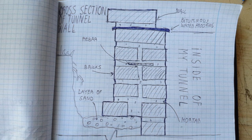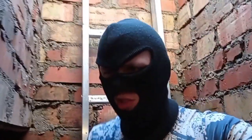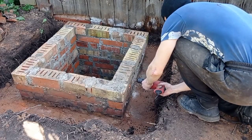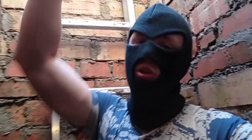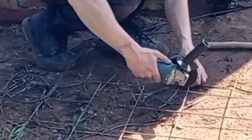Then I laid down some bricks on the ground, and the same mistake came back to bite me in the ass — the same mistake that happened at this very pillar. The foundation wasn't connected to these walls; there wasn't any type of brick overlay, it was just one brick next to a second brick with mortar in the middle. So I did the same thing as I did for this pillar: I drilled a ton of holes into the upper part of these walls, then put tiny pieces of rebar everywhere, then started laying the bricks. That rebar is going to connect the foundation with these walls and hopefully make the whole structure more rigid and more durable.